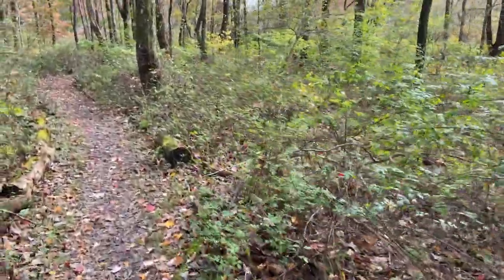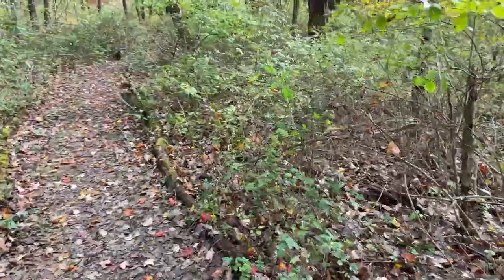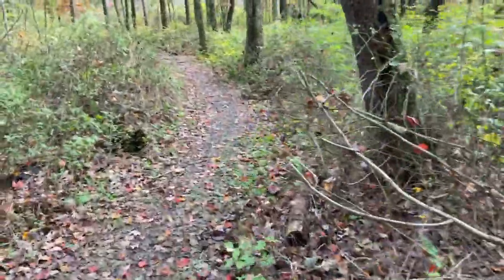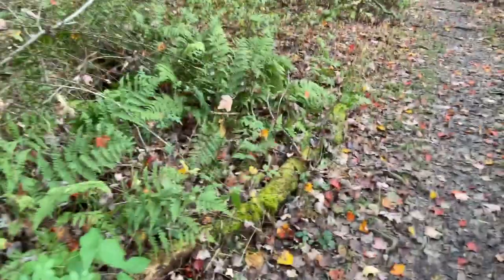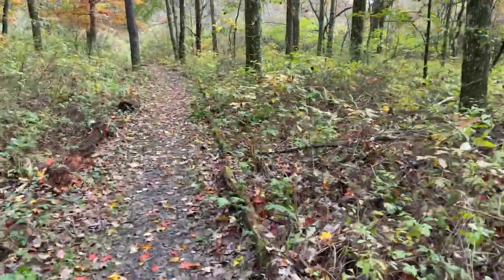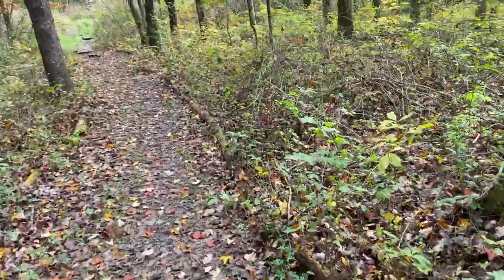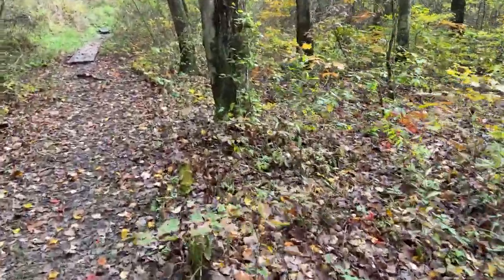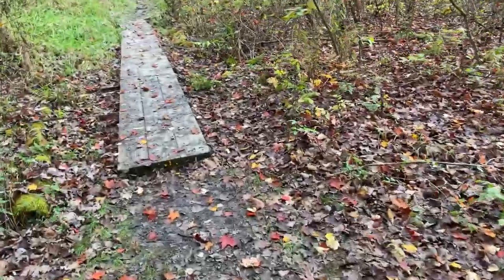You can start small — I have a small three-foot bog bridge at my place right by a creek. It does get covered in water sometimes because it's not quite tall enough, but during the times I'm hunting it's usually pretty good and I can walk down through there, where before I couldn't even cross that area and would sink in up to my ankles. It's not that difficult: lay some 8x8s or 6x6s on the ground, bolt some planks down, make sure they're nice and heavy. I like rough-cut green lumber if you can find it because it's not going to crack. If you're not using rough-cut green lumber, you're going to have to use pressure-treated. The whole thing about these bog bridges is they're made out of materials found in the local area — from downed trees — and when they rot, they go back to nature and won't contaminate it with chemicals.